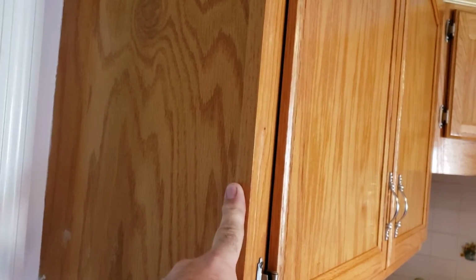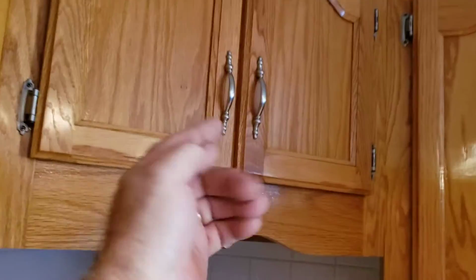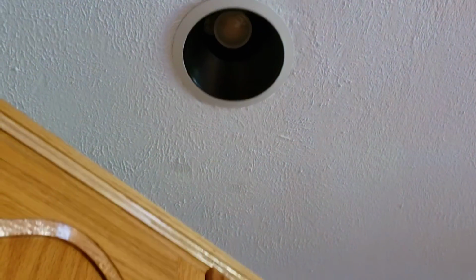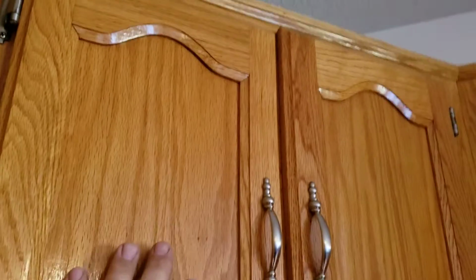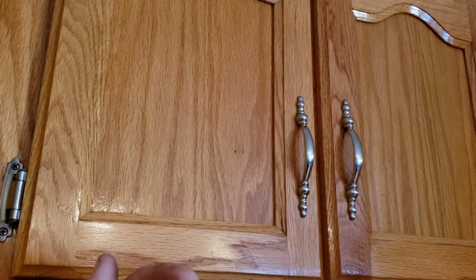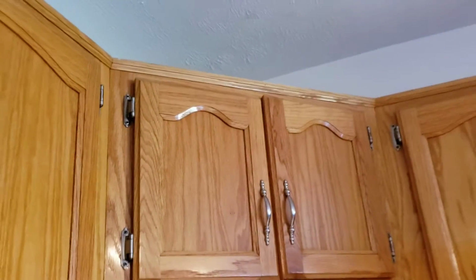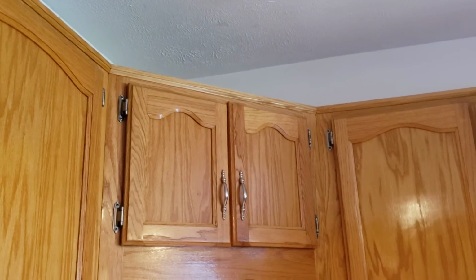Again, if you wanted to do these cabinets at 13 inches depth, that will make this center bridge slightly smaller, but it will bring that bridge forward, toward the front of the sink. If you take a look, there's a light right above the top of this. This cabinet is about center line of that light. So if this comes forward a little bit from where it's at, that'll help with the repair in the ceiling, and the crown molding and everything would probably cover where that repair has to be done.